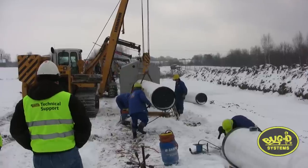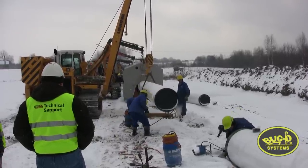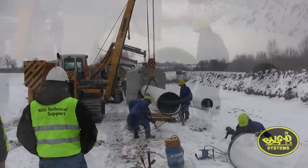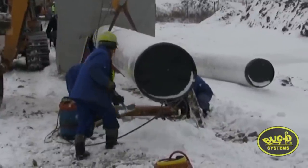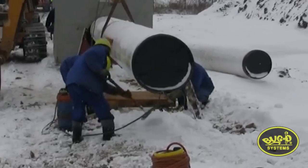As the line is assembled and welded, the pipe is supported by the side boom tractors. After welding, the pipe must be supported above the ground to allow access to the bottom of the pipe. This is typically done using cribbing, which is usually made up of timbers stacked beneath the pipe. It is important to keep the pipe in as straight a line as possible, so each support must be adjusted.